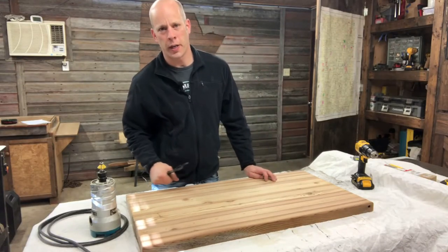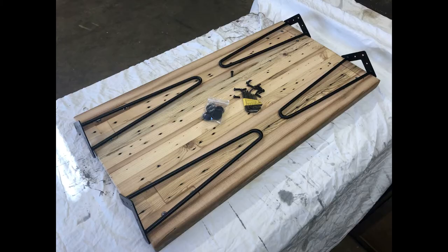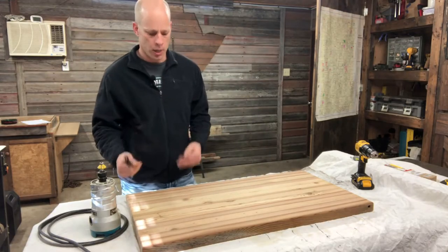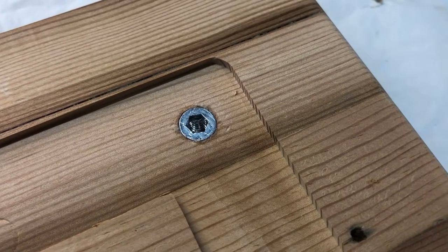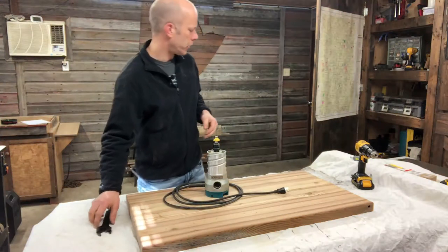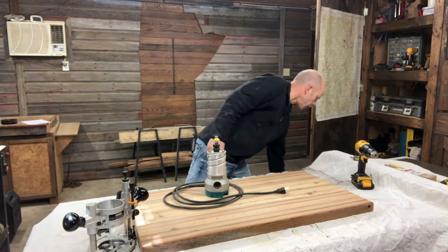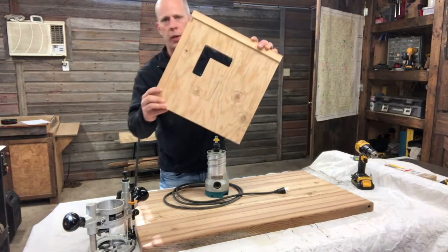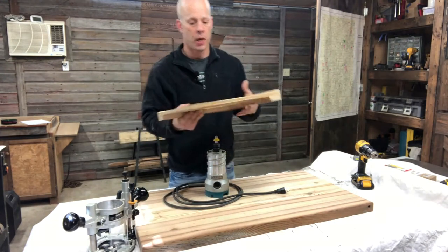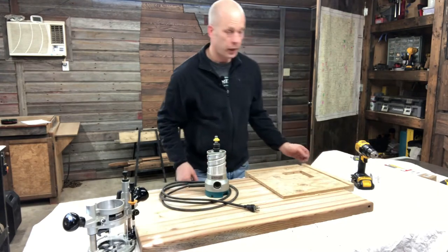Welcome to The Den. My name's Troy and today we're going to be attaching metal legs to this coffee table. Before we get to attaching these legs, because we're not going to be using the screws — we're going to be bolting these things on using threaded inserts — we want to make L-shaped recesses for these table legs. We're going to be using our plunge router and also a template that we made. It's going to slide right on the corner, we'll clamp it on, and we'll make our recesses.